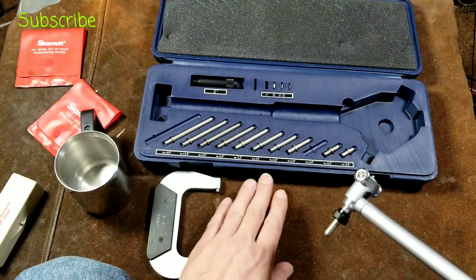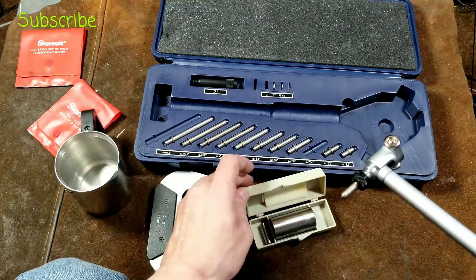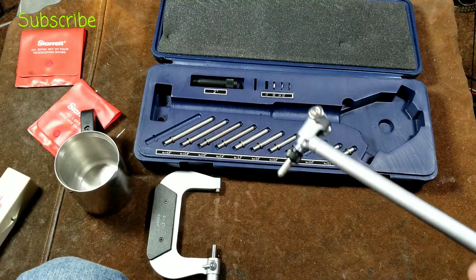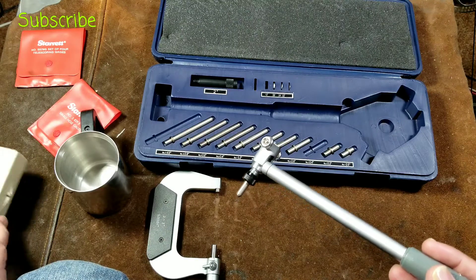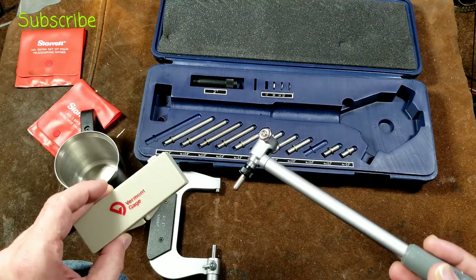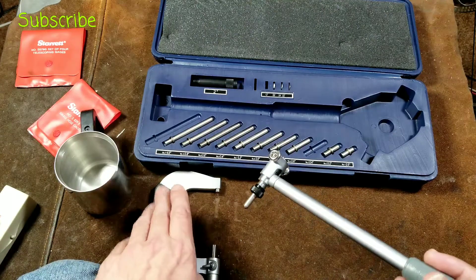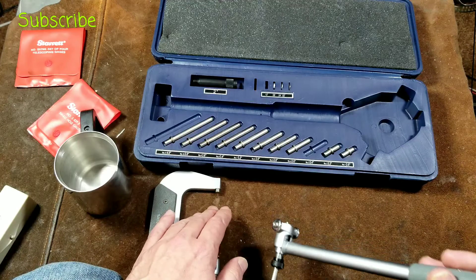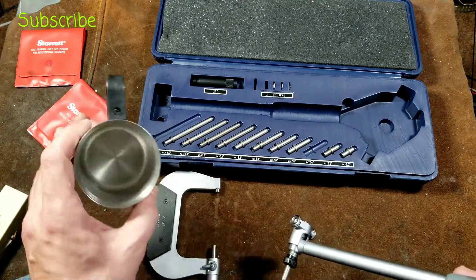The little trick is you do need to have a micrometer. You'll want to have some gauges such as this — this is a plug gauge that I use that's less than one ten thousandth of an inch inaccurate, so it's known as an X class, measured in hundred thousandths of an inch of accuracy. So you'd use that to make sure your micrometer is accurate, and then you set your micrometer for what your base value is. You need to have a pretty good idea of what the size of the bore is.